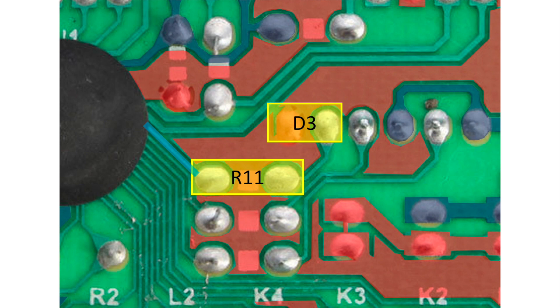The next mystery section is a place for another diode or LED beside the two currently installed. The two installed LEDs are connected to some kind of signal from the IC, go across a resistor to drop the voltage, across the LED, and straight to ground. But this unpopulated one works in reverse: the five-volt rail comes in, goes across the LED, then down through a resistor into a signal line going into the IC. I have no idea what the purpose of this one is - it's definitely controlled by the IC for some mode, but I don't know what it's for.